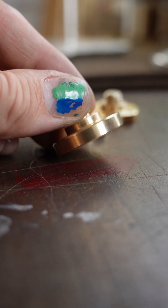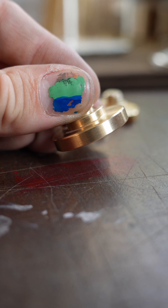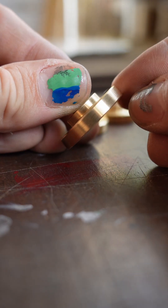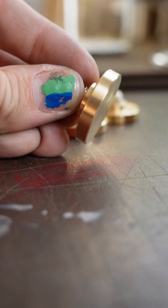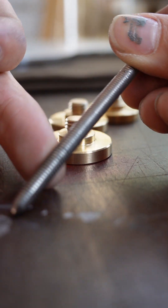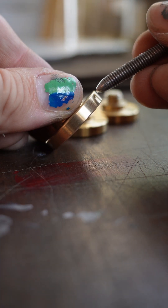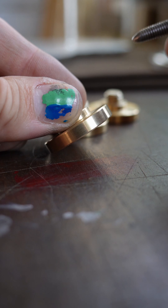As these feet are designed to be gripped and rotated to balance the base, we want some kind of texture on the outside, so we're going to do a hammered finish. I have this little tool that I made a few years ago — it's just an old bolt with the end rounded over. I'm going to clamp this in a vise and then use a hammer and texture the outside.